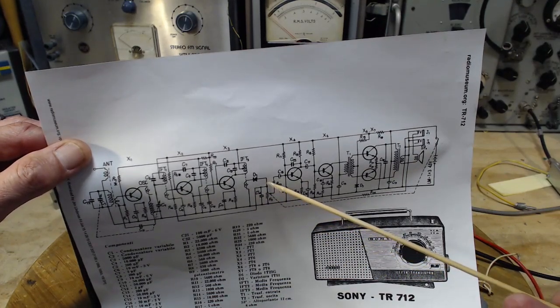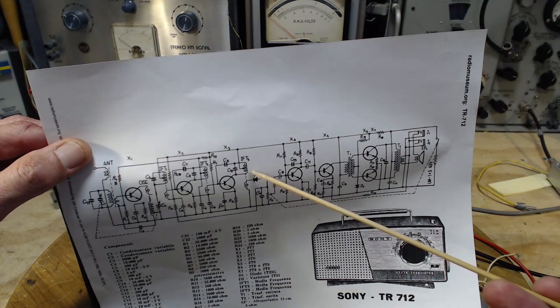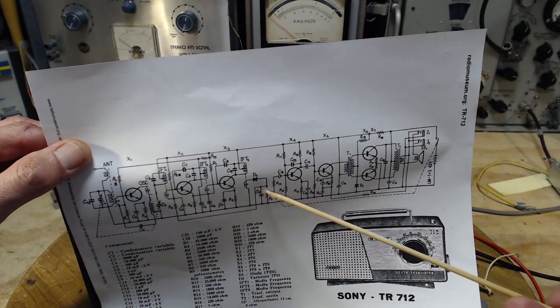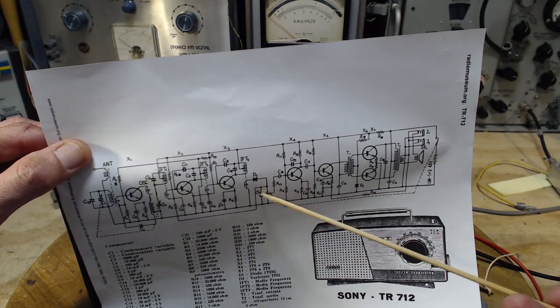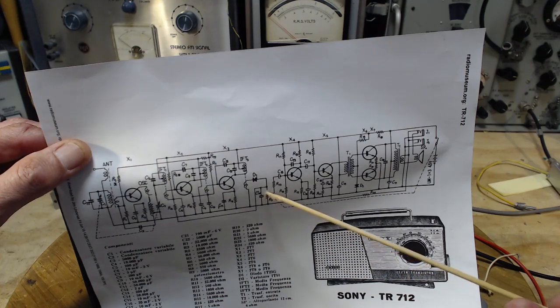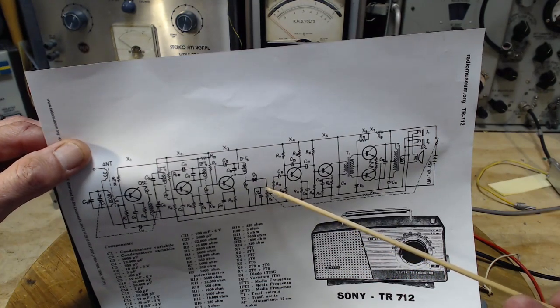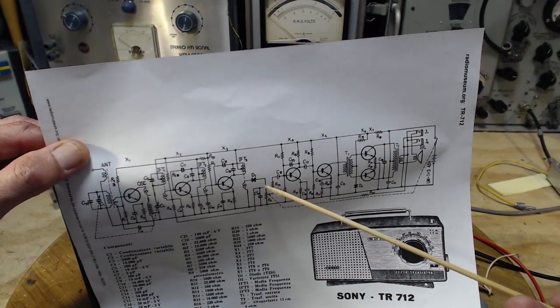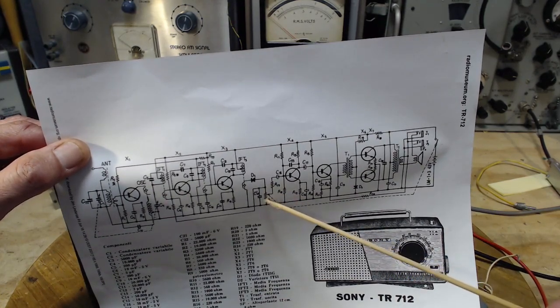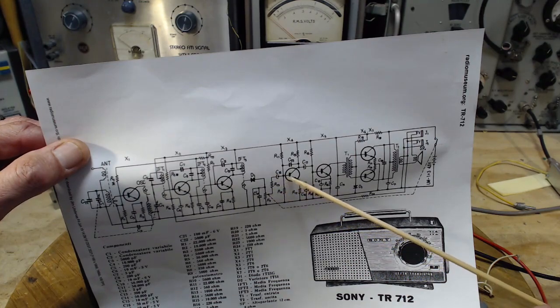So now there's RF here, 455 kilohertz of RF. Some of that's still over here, and they want to get rid of it. So probably drain it out with this capacitor here. Now what are you left with? You're left essentially with the audio signal, the volume control here, so you can pick off how much you want before you send it to the base.